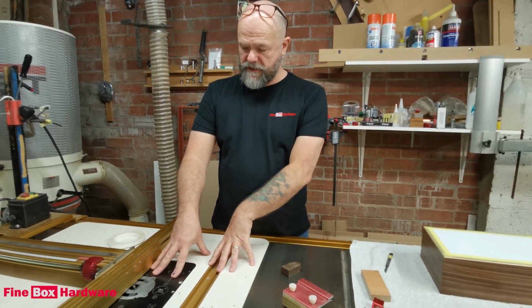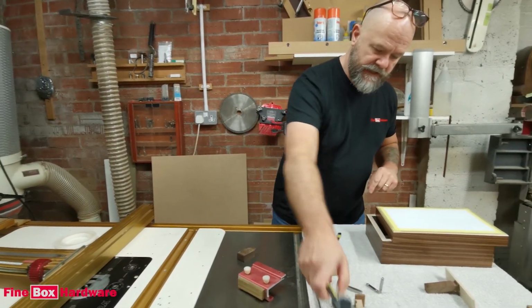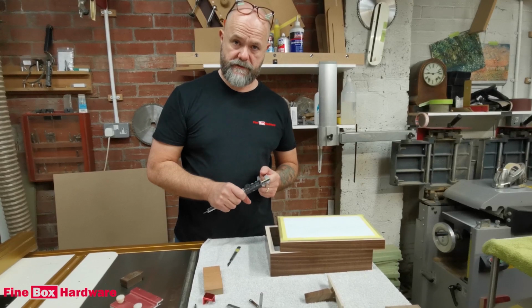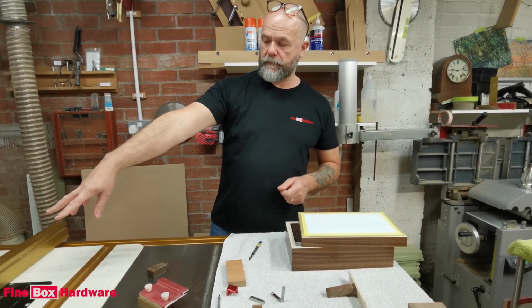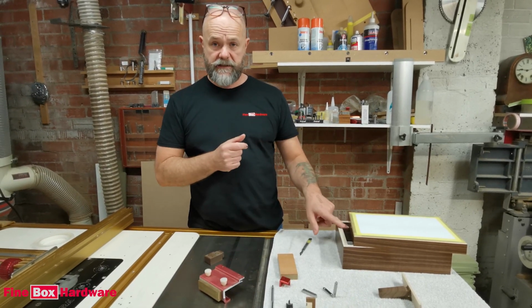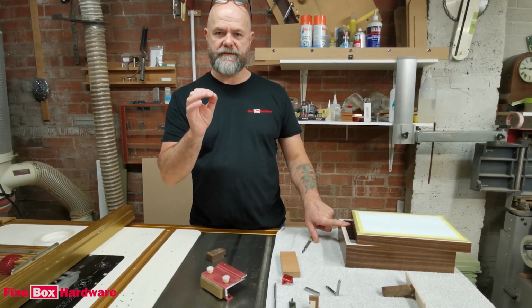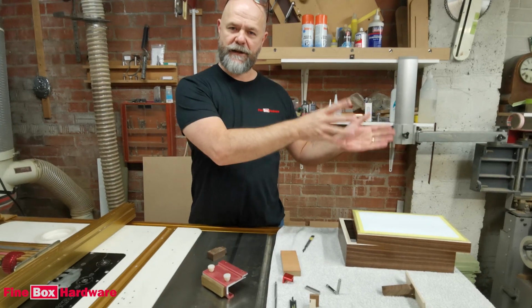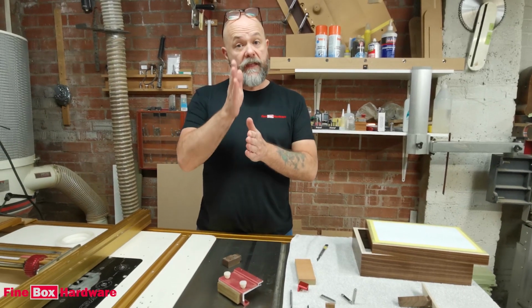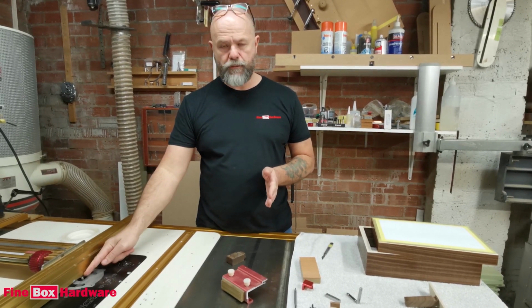And what I do first is I take a measurement of the box. I take a measurement of the wall thickness. On this, it's 14.5mm. Approximately an 8mm bit. Subtract that away from your thickness, and that gets you 6.5mm. I wasn't very good at school, I calculated this before. Then you divide that in two. That gives you 3.25. That's the distance you want between the fence